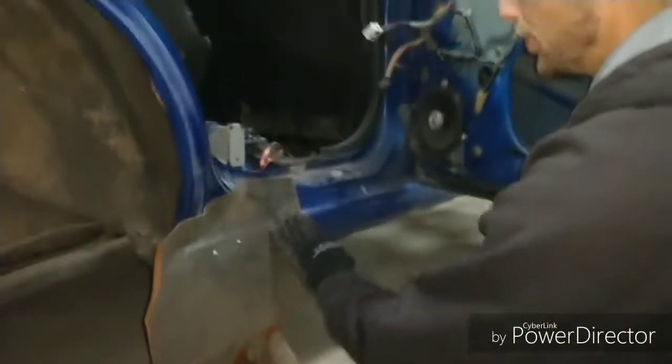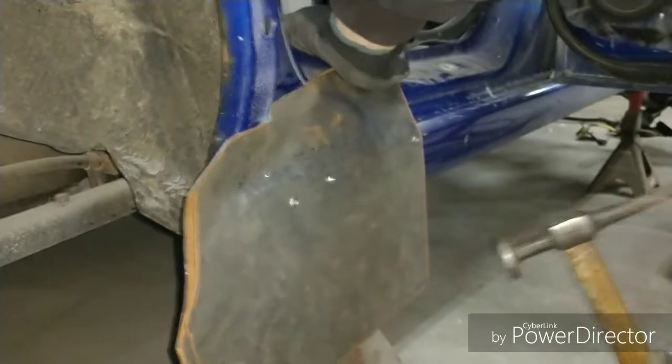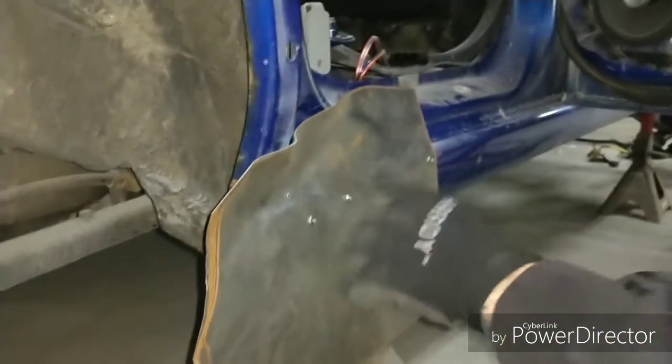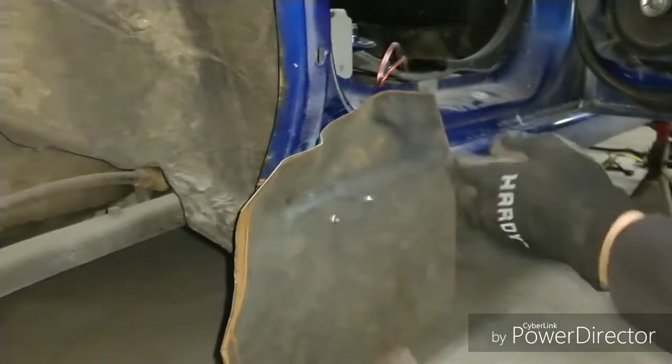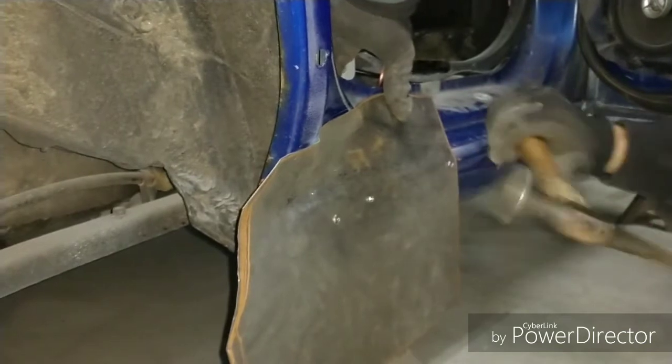Alright. So now I'm starting to manipulate that because I've got that stress out. So I'm going to use the flat hammer. Just continue to hold pressure up onto the top so you have less bounce. There's a high spot. You always address the high spot first. It says hi to you, so don't be rude. Shake its hand, you know. It says hi, so say hi back.